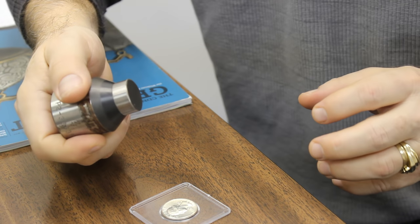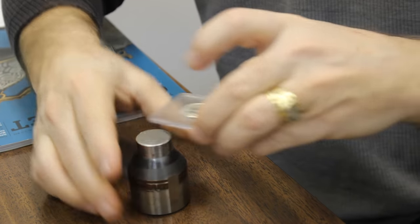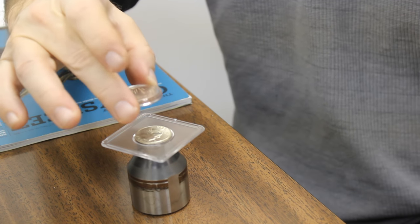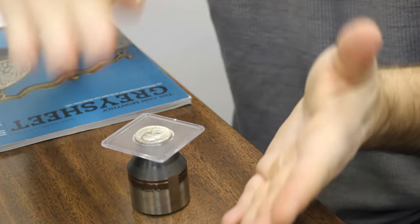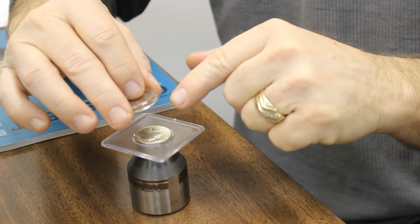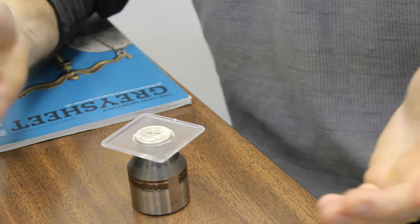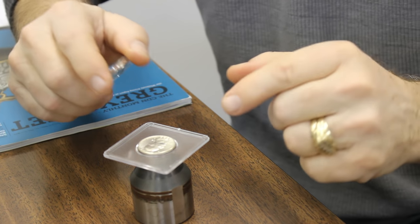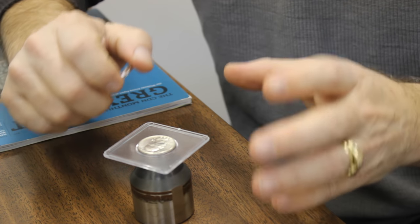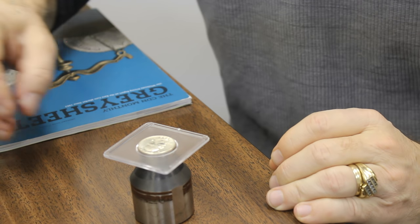We'll look at a few more examples of things that can happen in the coin chamber. Hopefully the visual helps you understand it, because that's one of the things people don't realize. This is basically what the setup is — it may be to the side, it may not be straight up and down. You've got your hammer die coming in and hitting, and these coins are being puffed out and coming back in. It's really fast. This is hard on the dies and hard on the coins, and if things aren't adjusted exactly right, you're going to have an issue. A lot of times it's minor, sometimes it can be dramatic.